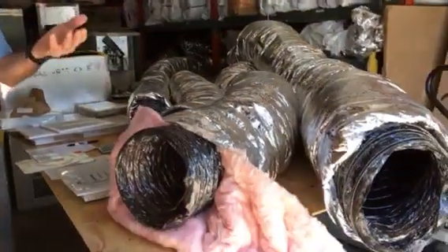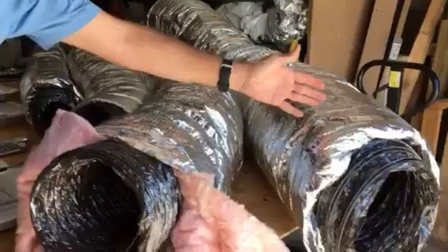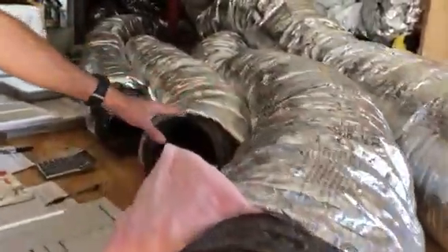So let's talk about flex sizes. You've got 5-inch, 6-inch, 8-inch, 10-inch, and 12-inch flex, and you can also get 5, 7, and 9-inch flex for different applications. For a typical bathroom — maybe 100 square feet, 10 by 10 or less — you want a 5-inch flex. For a typical bedroom that's 10 by 10 or maybe 14 by 14, go with 7-inch flex. The rule of thumb is about 1 CFM per square foot, or 0.75 CFM per square foot, but there are many variables.